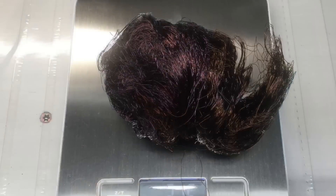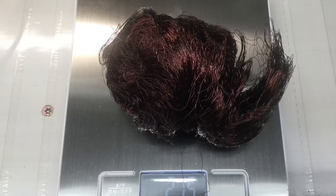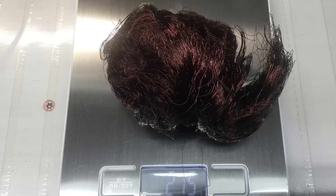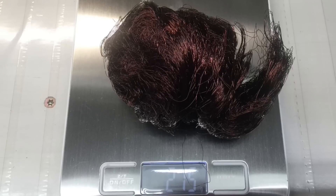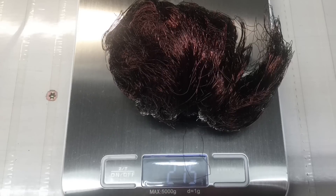Doing some more research, it looks like the 34 AWG was a really closer match when I look at the weight of the magnet wire that was installed in the coil, in addition to making some DC resistance measurements.